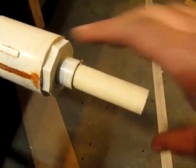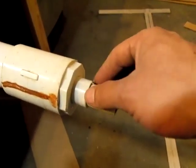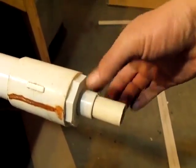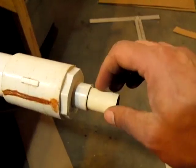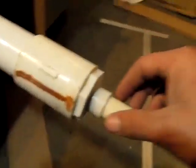When you connect sections together, this piece should be just enough for the fitting — you're going to have it mirrored on the other side. Wrap a little bit of foam insulation around there just because you're going to lose a little heat at that spot, but it's not going to be really bad. You get the advantage of the entire length of the pipe wrapped in a vacuum.